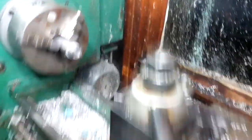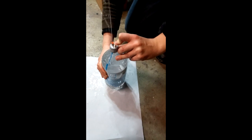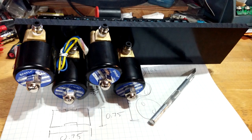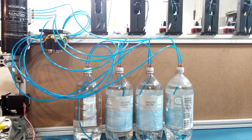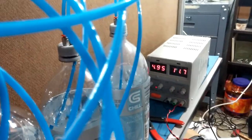Let's take a look at what it looks like. Put it in, screw the cap down, and you're ready to go. So when you add pressure to it, this is what happens. These are the solenoid valves adapted to a plate, attached to the top of the drink bowl, then you place the cords in there. Here's a demonstration of all four bottles draining at once. The pressure from the CO2 tank is providing about 10 PSI, and we're able to pump water from those four into the cup.